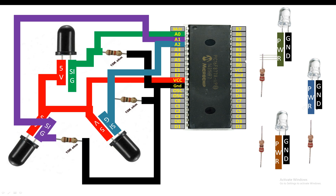For the top LED, connect the power pin to one end of the 220-ohm resistor, then from the other end use any available GPIO digital I/O pin of the PIC. I'm going to use pin C4 for the top LED.